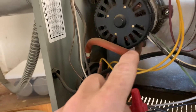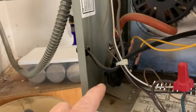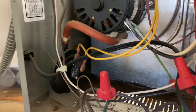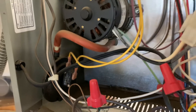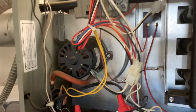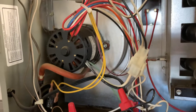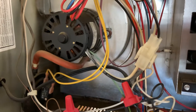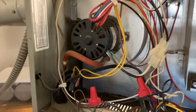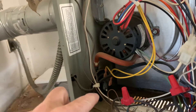As a safety device, you'll see a little tube coming off of the combustion chamber. That's a vacuum tube, and it connects to something called the pressure switch. That's a safety that makes sure you're drawing a vacuum through the combustion chamber, clearing all exhaust gases and any unburned natural gas. For the problem I was having, I came into the garage and it was blowing like normal — the main blower motor was running — but there was no heat. I'm wondering how long I was exhausting natural gas out into the open air. That doesn't sound very safe, but we'll talk about that more.